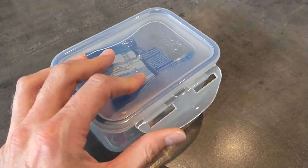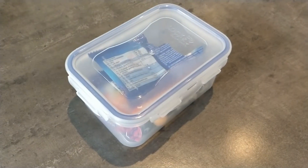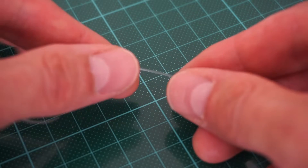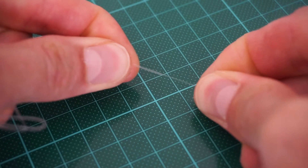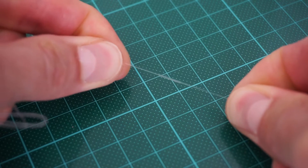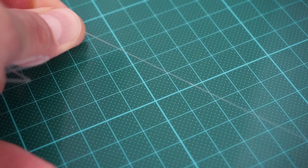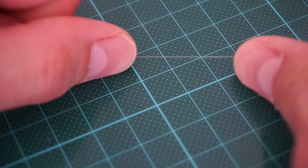These mechanical properties make it very suitable for making parts with living hinges. The toughness of the material can easily be made visible by subjecting the material to stress. After some initial elastic deformation the material quickly starts to show plastic deformation. This also happens with living hinges the first time they are bent. The outer layer stretches to accommodate the full bend, after which the material relies on extremely good fatigue resistance to allow for countless bends without tearing or breaking.